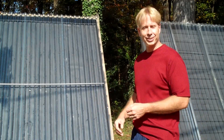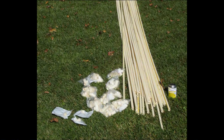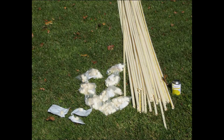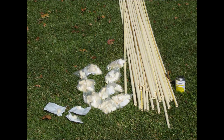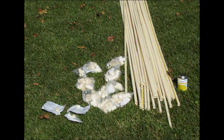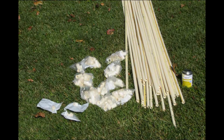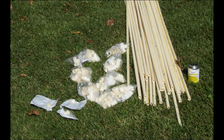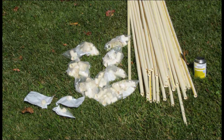I'd like to show you how Brad and I put this together. If you've never done a solar project before, this is a great introductory project — super easy, anyone can do it, and it works well. I built an 8-foot by 8-foot collector, 64 square feet. With risers spaced 3 inches apart, I ended up with 32 CPVC risers and 64 tees. The tees are inexpensive — only 19 cents each. This is all half-inch CPVC, with connectors and Flow Guard Gold glue.